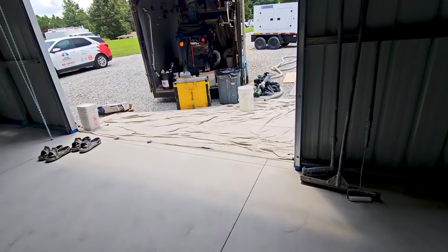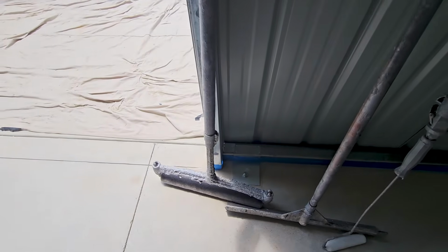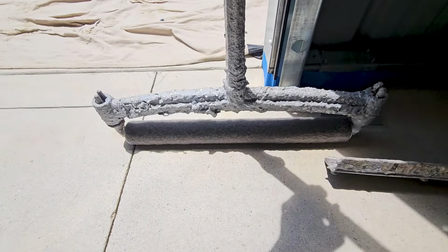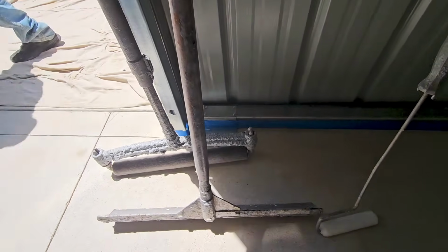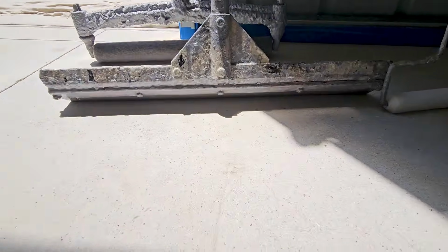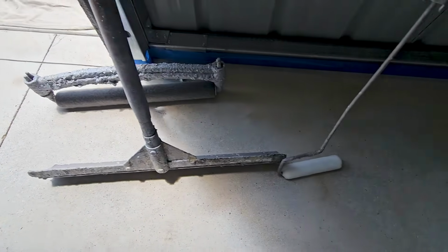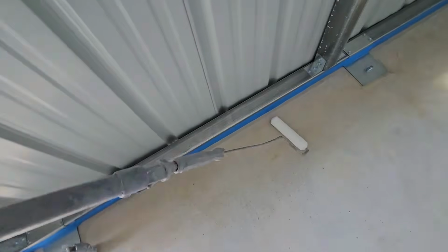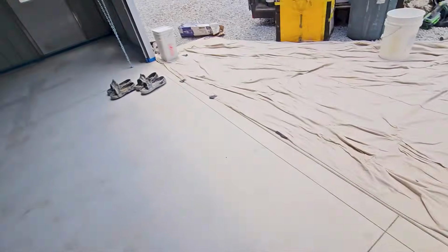This is it. I'm trying to drop the floor. These are the tools of the trade. We're going to be using an 18-inch Wooster roller right here. That's going to be used for the back rolling. This is our squeegee, an 18-inch LDPE, an abbreviation for chemical resistance. That is a squeegee that has walked miles and miles. And then the 6-inch roller right here is going to come in and do the edge work. Those are the tools. We got the spike shoes over yonder.